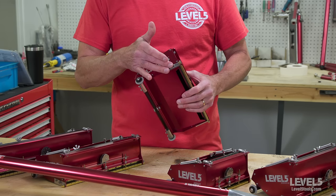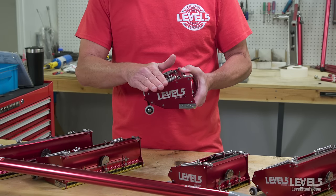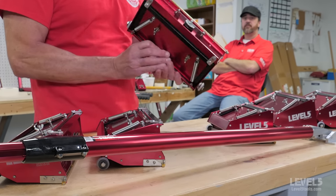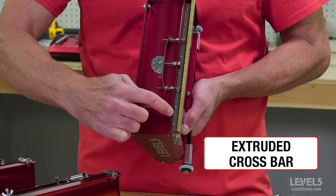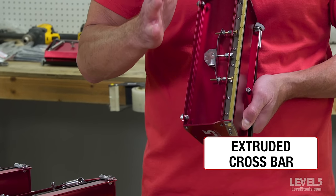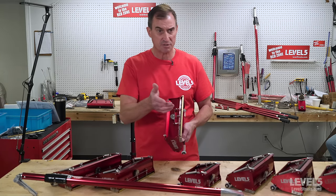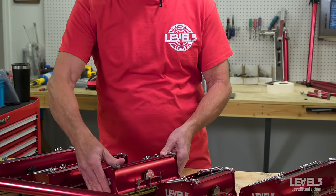Some guys don't like the black wheels — they leave a track on the wall. You've got your traditional shoes and skids on the side that hold in your brass blade holder. We've got extruded aluminum CNC machined side plates and every one of these extrusions is custom. You'll notice even on the front we've incorporated this crossbar into the extrusion versus that being an independent piece from some other brands — just one less thing you've got to mess with from a maintenance perspective. To change the blade, very simple: you just pop it out, put another one in. You'll see a video on that later, and then also just the brass blade holder — very simple design.